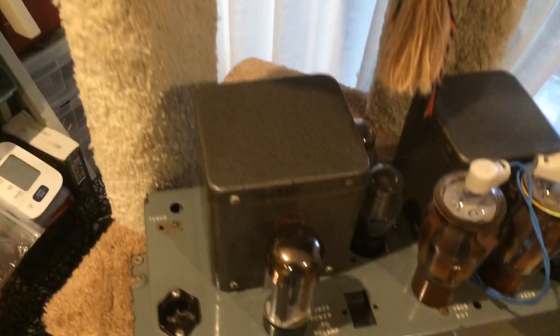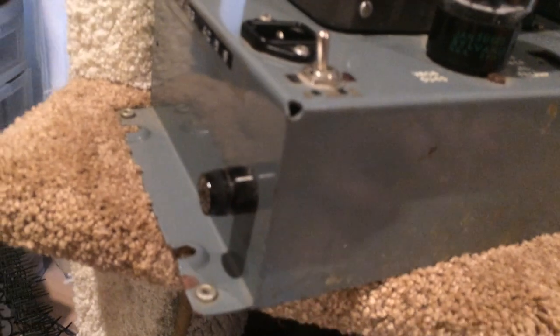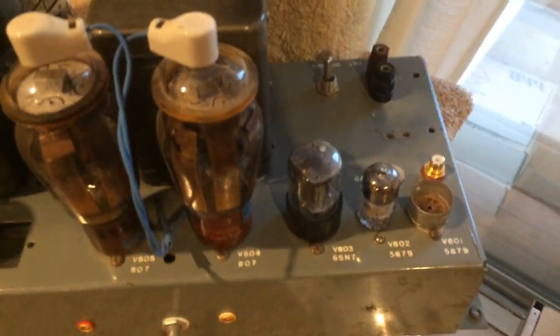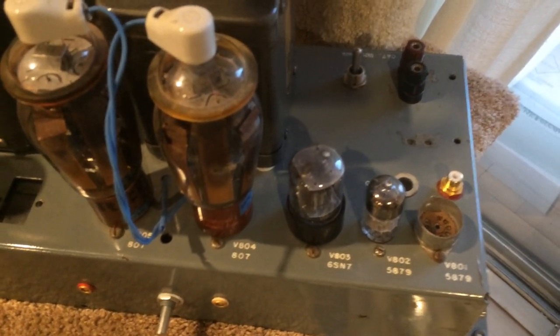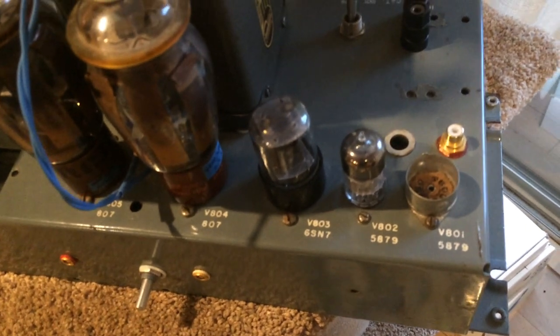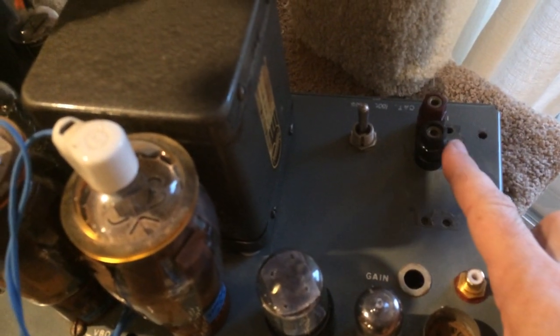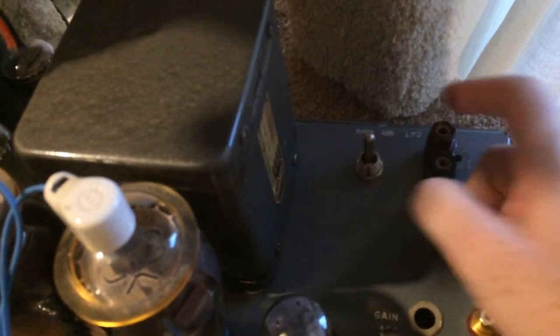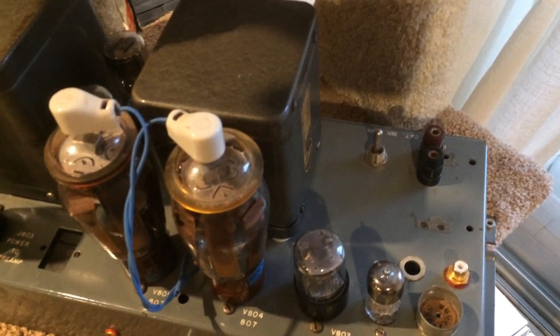This is how it looks after it's been rebuilt — this is the second unit I already rebuilt. There's a power switch here, input for the AC, and a fuse. I took out the first tube so there's only one pentode; this way it has full output at 160 millivolt input, so it's super sensitive and you don't even need a preamp to drive it. I put the RCA jack in here and the speaker binding posts, and there's a phase switch — I put phase switches on all of my amplifiers so you can flip the absolute polarity of the sound.